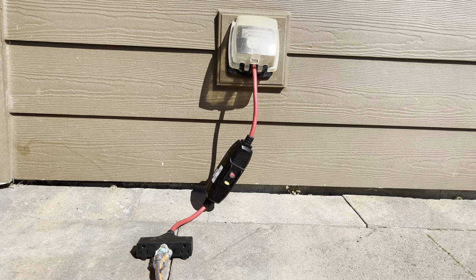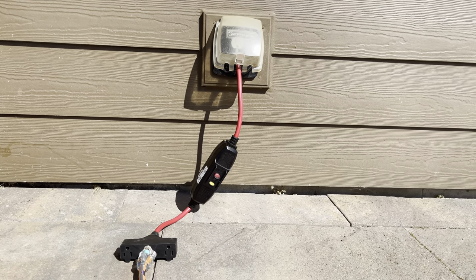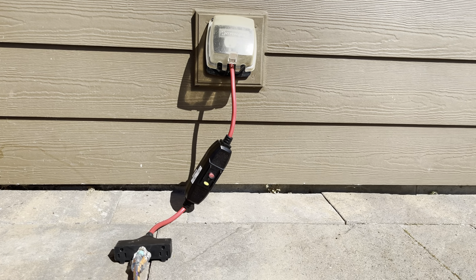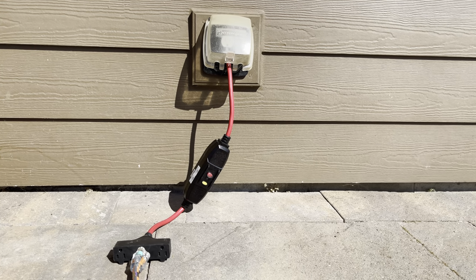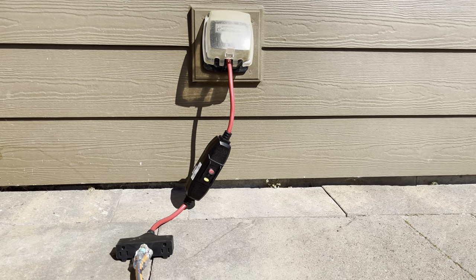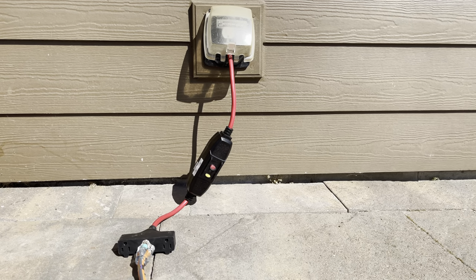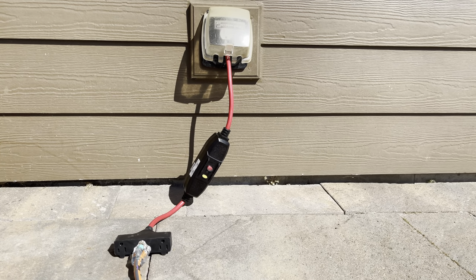If you're plugging in anything for use with your pool, you need GFCI protection. I would recommend something with at least 12 gauge wire, like this Husky that I bought at Home Depot. I'll put a link or two in the description to portable units like these that I like. But really, folks, you have to have GFCI protection.